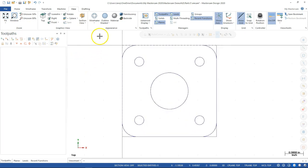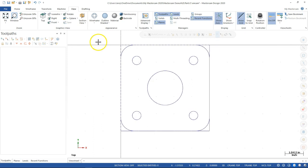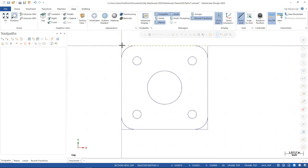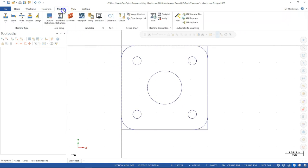All right, so questions up to this point? So this may be another one, since the 1/2 inch, 2 inches deep doesn't really do all that much. Maybe we'll make that a 1/2-13 or a 1/2-20 tap, and that'll be optional. If you want to put that in there or work with it, adding a few more operations. Occasionally, either that or maybe a ream since we tapped last time. We'll make it a 500 plus or minus 1/2 thou or something. I don't know. All right, so we come back over to the machine.